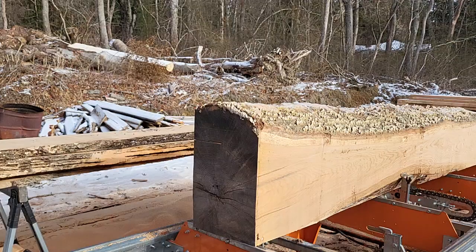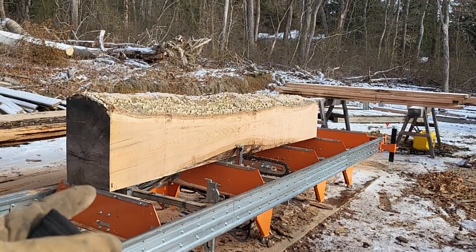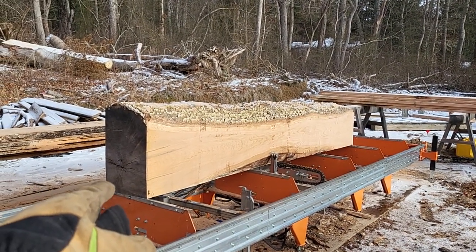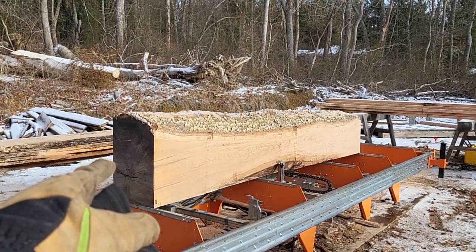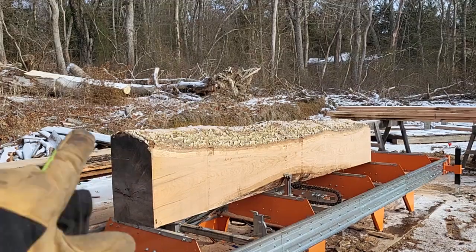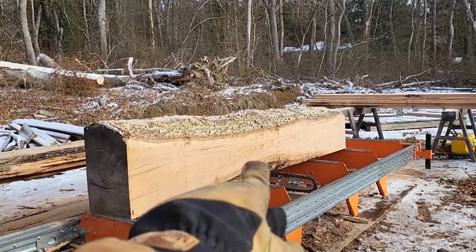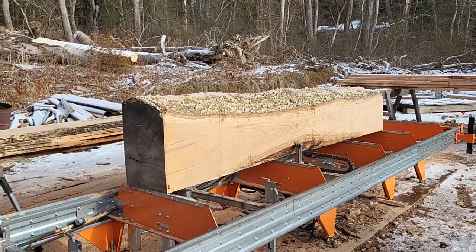And then when we rotate it, we will take a 2-inch flitch out of this side. Well, we don't even really need to, because we can just take it out of the... you're going to have, might mess with that other 6 1/2. I need to take the top off this, take the 2-inch flitch out, then roll it, or I'm going to lose a board in the middle there. If I don't take that 2-inch flitch off that side where all that wane is, I lose a board down the middle of that flitch.